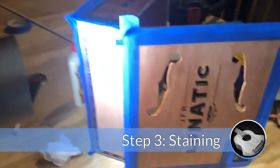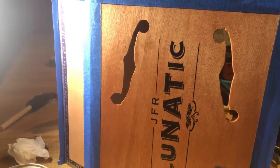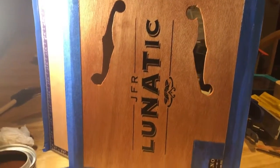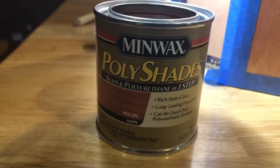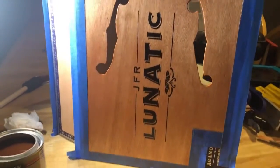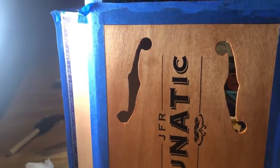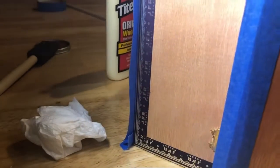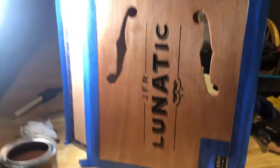For the next part of this build, I decided to stain the box. Originally I was going to leave it plain, but then I thought it might need some protection. So as I finished the F holes as good as I'm going to get them without any precision tools — they don't look horrible, they're not perfect — I decided I was going to stain it. I'm using some Minwax Poly Shades, which is stain and polyurethane in one step, because I don't want too thick of a coat. I taped over the tape on the box because I want to keep that tape aesthetic and protect it. You can see the color difference between the pecan and the unfinished wood, and I think that was a good decision.